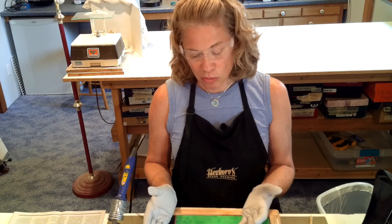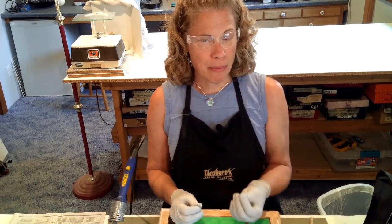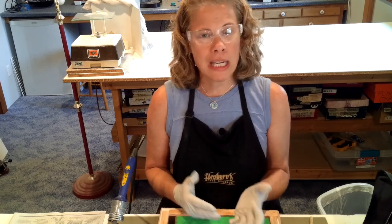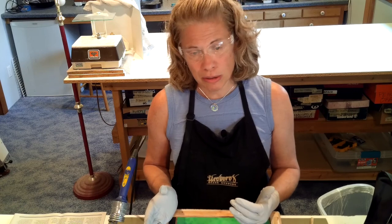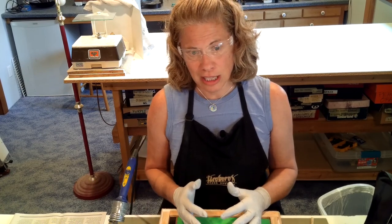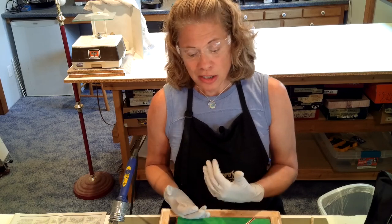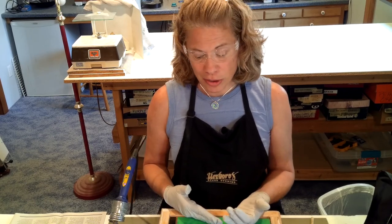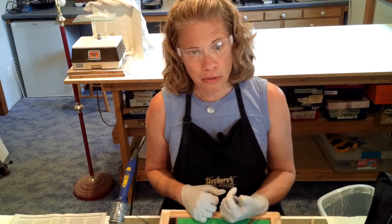And what happens is if you fully bead solder in the jig, that backing actually can melt in parts and it crinkles, and then you can't reuse the jig. So when I'm doing a super big project, I usually don't reuse the jig. I just bead solder in the jig and skip the tacking phase. But a lot of these beginner projects, I reuse the jigs, so I want you to tack and dump it out. Also, it will teach you how to tack so that you'll know how to do that for later when you go to put your frame on.